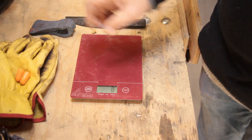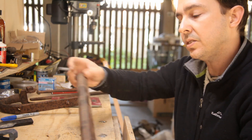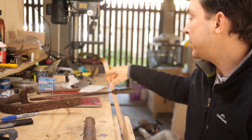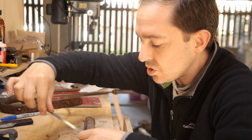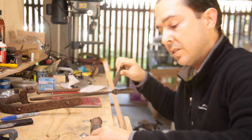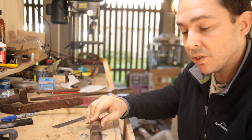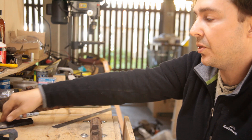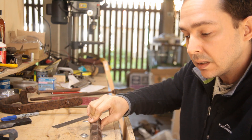What we're going to do is make a new eye drift. I'm going to take this piece — I don't know what it is actually — a pointed chisel, single point chisel. It's inch and an eighth flat to flat, or inch and a quarter across the points of the hexagon. We're going to upset a little bit on the end and draw out a new hammer eye drift. This one will be a little more multi-purpose, up to quite a bit bigger, and try to keep the thickness upwards of about 19 to 20mm if we can.